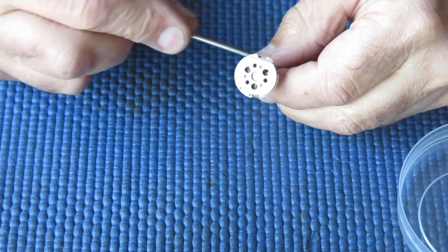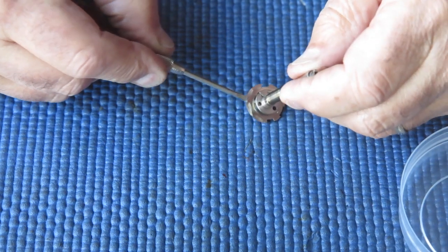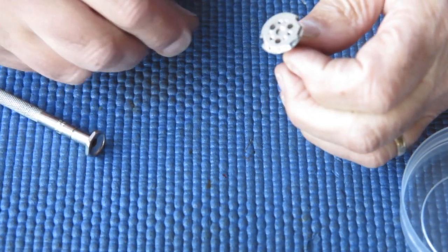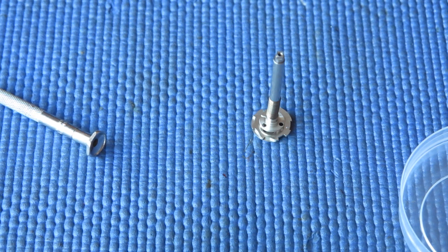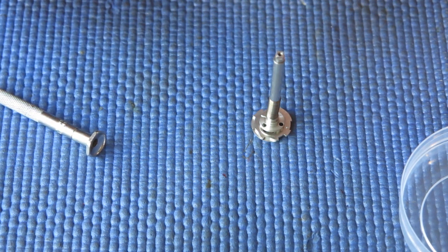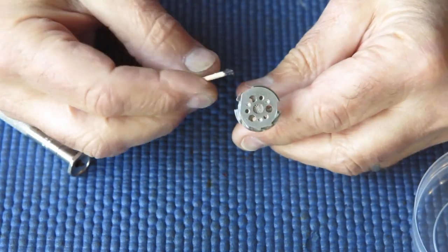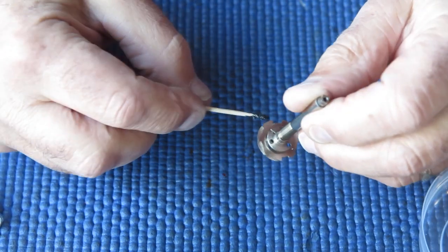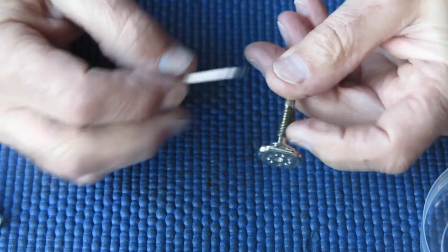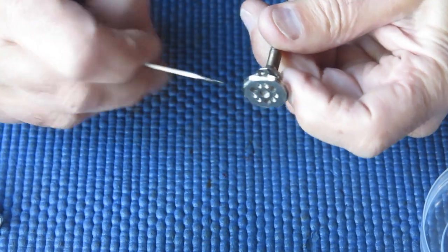Now the shaft has like a ratchet cam on both the top and the bottom surfaces. They run in different directions. Effectively, it's to ensure that when you start swinging the film advance lever in the advance direction, it can only continue moving in the advance direction until it reaches the end of the stroke, whereupon the release lever pops up to the top position through a gap here, and then the lever can only rotate back the other way. So you can't inch the film advance on a Retina Reflex, or most of the Retinas for that matter.